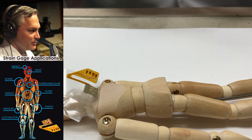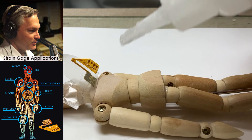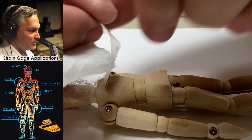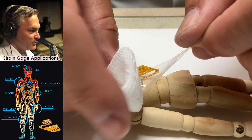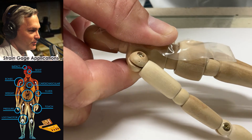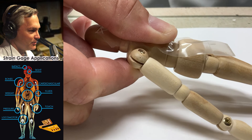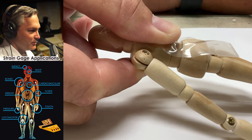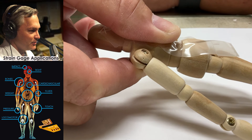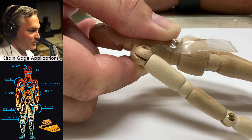I've waited my full 60 seconds. Since this is a limited amount of room, I'm going to apply the adhesive right at the junction of the tape and the mannequin — a little bit extra, more than I probably normally would. Then I'll pull it over and wipe it up underneath. I'm going to take my thumb and put it over top of the whole thing, and now keep it on there for a full 60 seconds. The great thing about this adhesive system is cure only requires thumb pressure for 60 seconds. That can be hard if you're reaching up overhead or up underneath a vehicle, but you do need to give it a full 60 seconds — so get a watch, get a timer, get a friend — whatever you need to time it.